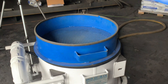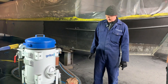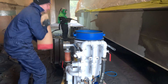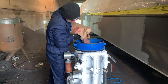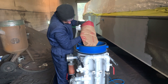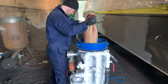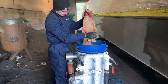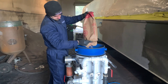The two abrasives we've been trying are a slag material — an iron silicate, which is a very common abrasive used on steel blasting — and GMA garnet. Garnet is a very environmentally friendly abrasive; it's faster than the slag materials and gives a very uniform finish, so it flows very well through the machine. We've been comparing the garnet versus the slag material.